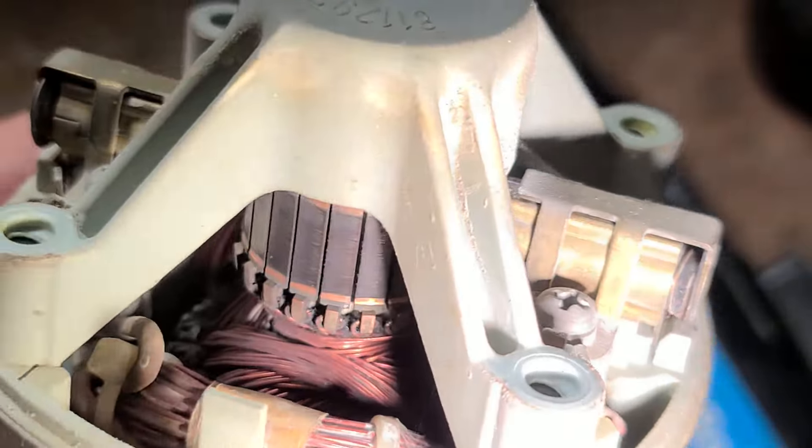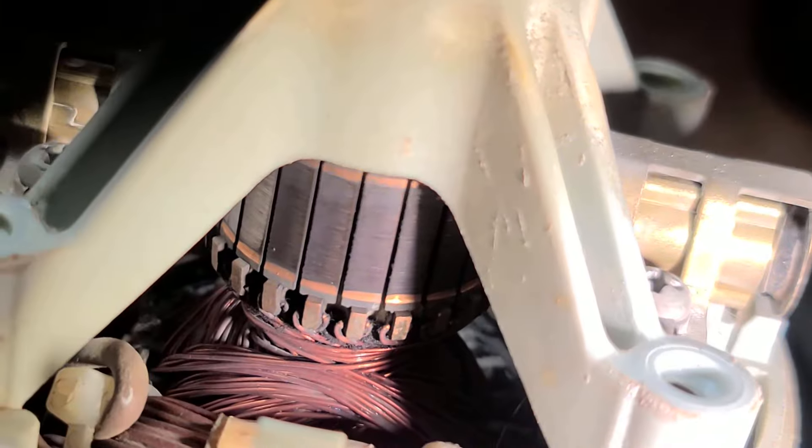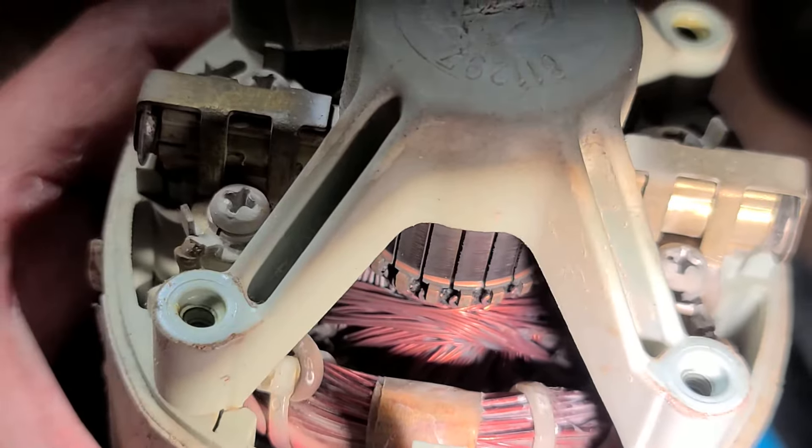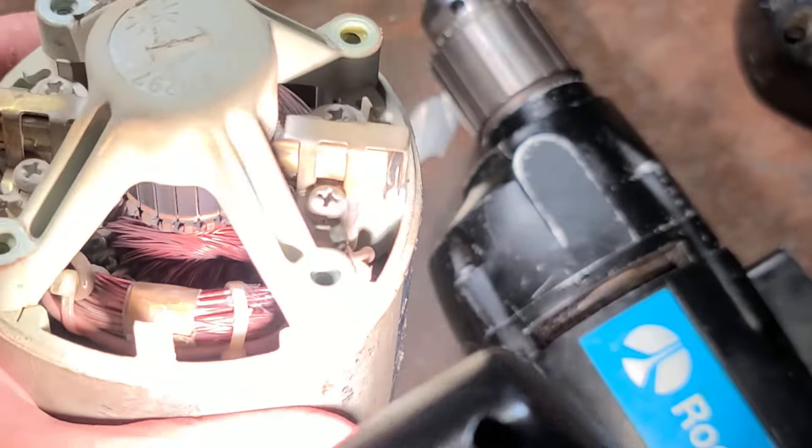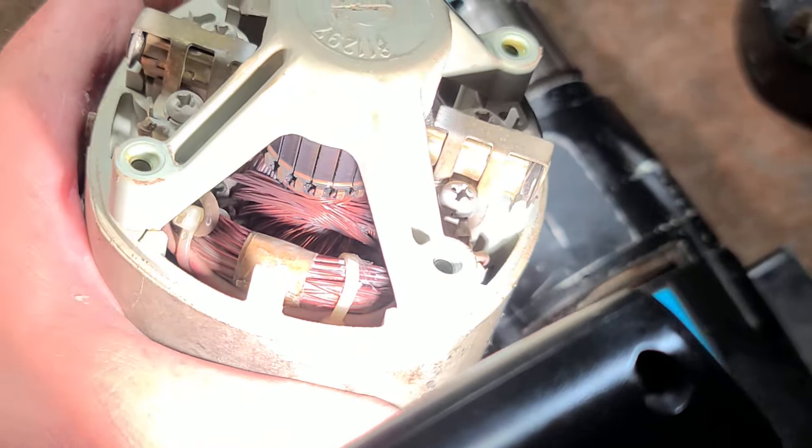It's pretty compact and not too bad to change the brushes because you just pull off the cap, pull out those couple of screws, and it allows them to have a pretty long brush in a pretty compact space. This commutator — this drill was used intermittently, and in the 1980s they really stopped wrapping jute around the backs of the motors and started using folded contacts. Some manufacturers still use it welded, but many just use folded contacts and this became the standard when they realized they didn't have to spend money on ultra-thick coatings of epoxy and wrapping everything with jute.